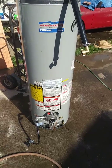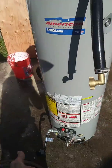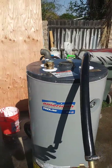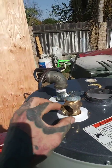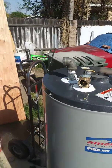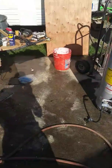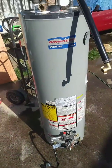If you don't have the luxury of taking it off, you can try to do it this way, but you're not going to get it fully out. You really want to be able to take the water heater off, tilt it, and allow water to flow through the top on the cold water end. Check all your valves, make sure they're sealed properly and not leaking. Do a thorough inspection and make sure everything's good. This is just a video on how to clean out that white corroded crap out of your water heater — it's a very good technique.